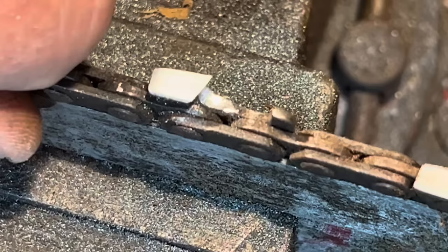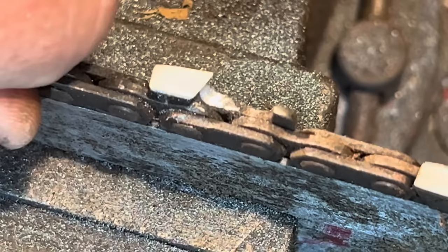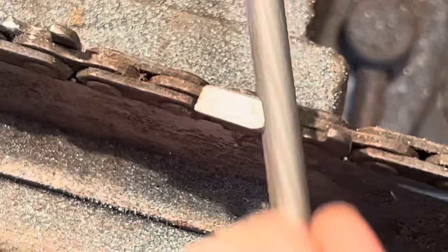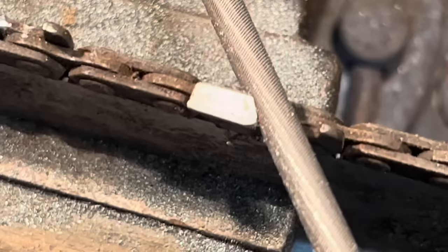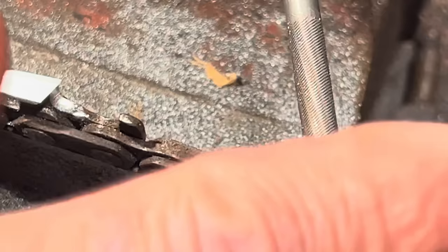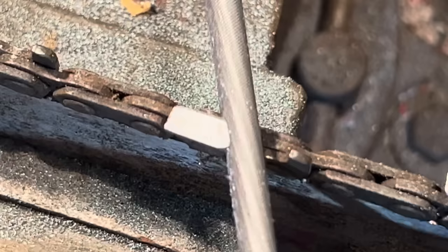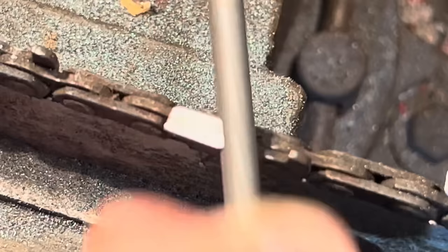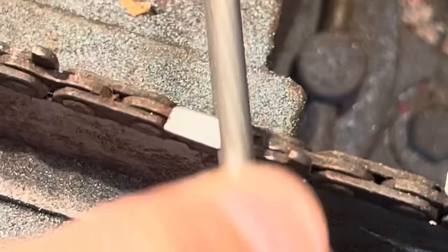And here we are - there comes our burr. I hope you guys can see the burr. It gets a little shiny, friends. You need to be touching the top plate. Your file needs to close this gap here - not be underneath it or going like this or like that. You need to come through like this. I hope that makes sense, friends. But the camera work - see, it's gone back to that other one. Look at this thing.